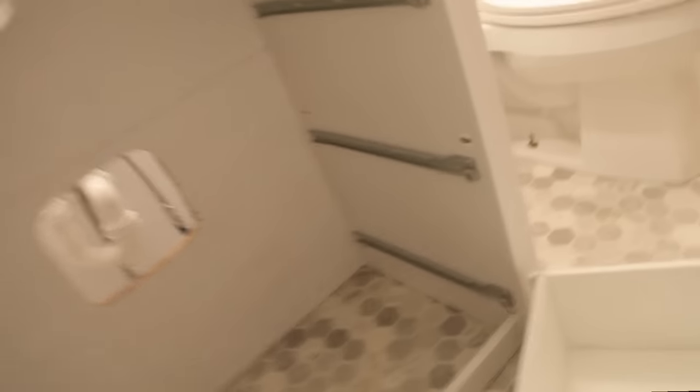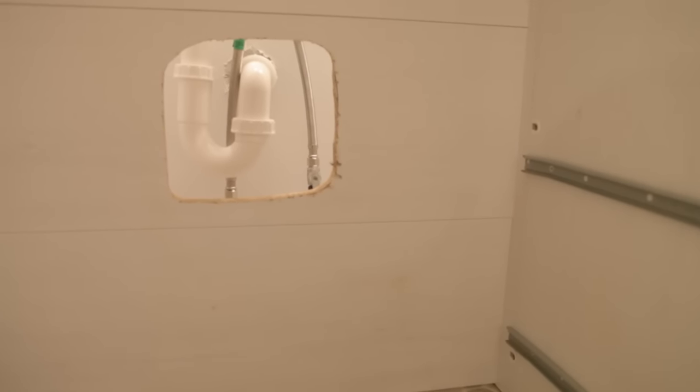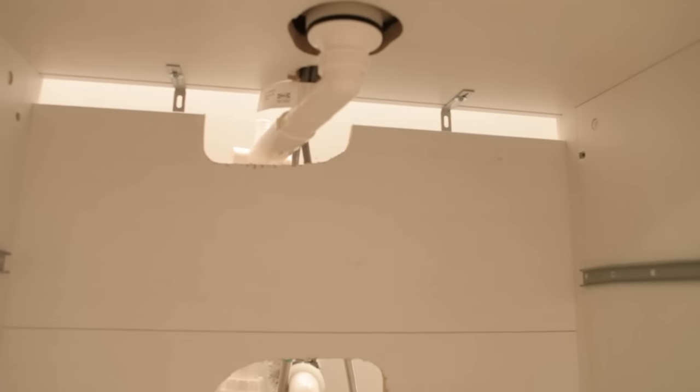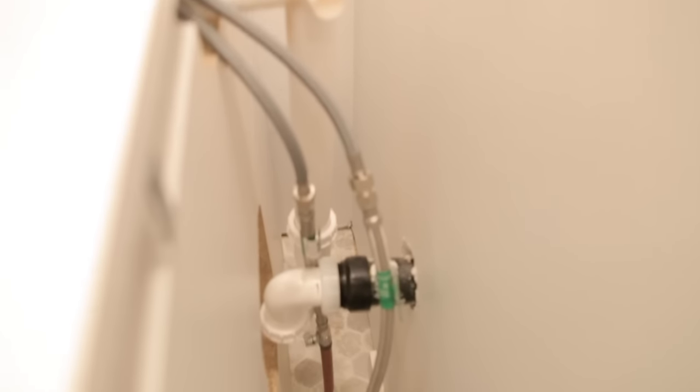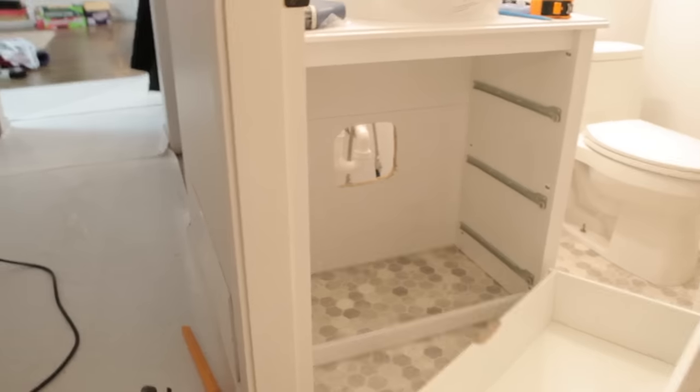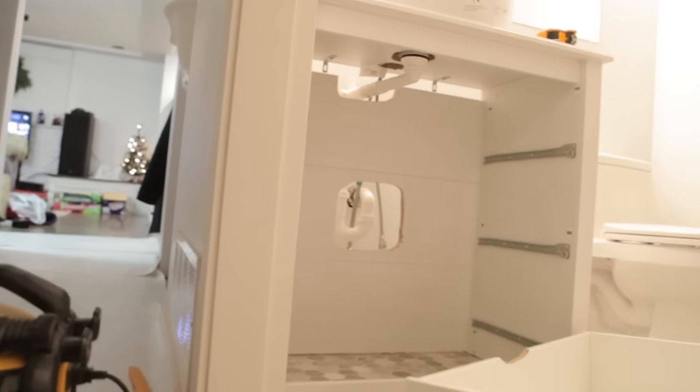It's the next day and I've cut an access point in the back of the vanity. I've also set up the drain pipe that came with the sink and bought two braided hoses from Home Depot to attach the hot and cold taps. I only had to notch out a small amount on the top to allow the drain to get behind the vanity — the low-profile drain that comes with the sink works quite well for this. Looking behind the vanity you can see the hoses and drain pipe are all set up: a basic U-bend, going from a one-inch pipe to a one-and-a-half-inch pipe connector, and taps for hot and cold. This whole area will be covered by a shelf so it won't be visible. I also had to cut a notch in the drawer to allow clearance for the drain pipe as the drawer pulls in and out.